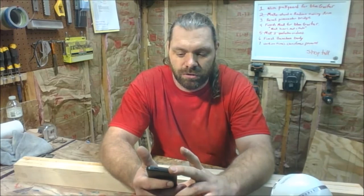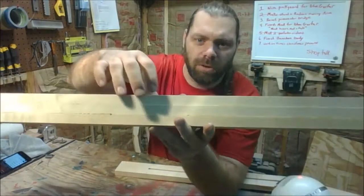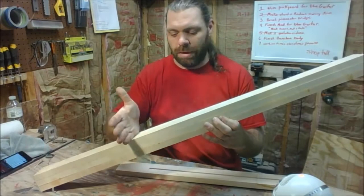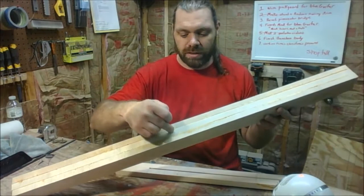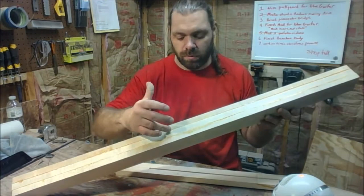Ken's question was: I would love to see how you constructed the neck, i.e. the neck angle. The neck on the Flying V guitar is a three-piece neck — you can see three pieces of wood glued together. These pieces are three quarters of an inch thick and about 30 inches long by three and a half inches wide. I take three pieces of maple and glue them together. For a four or five-piece neck, I add strips of walnut or mahogany in between, so it goes maple, mahogany, maple, mahogany, maple — five pieces.